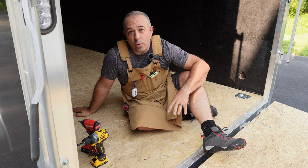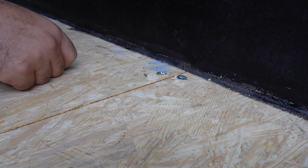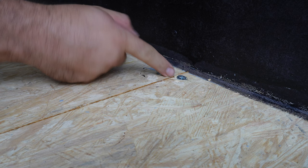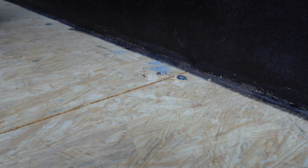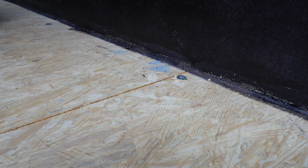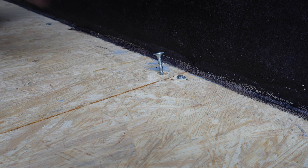Before we start installing this product, it is imperative that we do the prep work. Do not skip the prep work. If you're investing your money in a quality product like this, you want to make sure that you do your due diligence so that it turns out perfect. The very first thing is I'm going to evaluate all the screws in the floor and see if any of them are protruding. This one is crooked and really high up, which is going to create a big hump in my flooring. Rather than trying to drive it in, I'm actually going to remove it and put it back in with a large recess bit so it's flush with the floor.